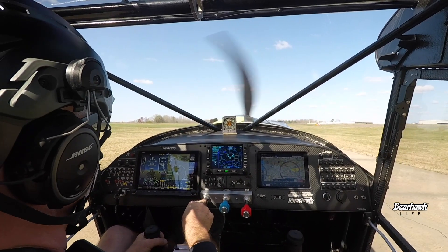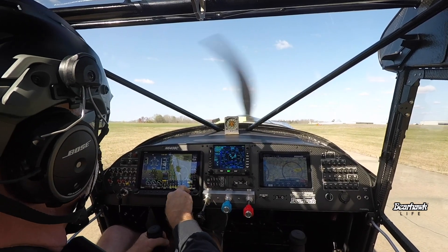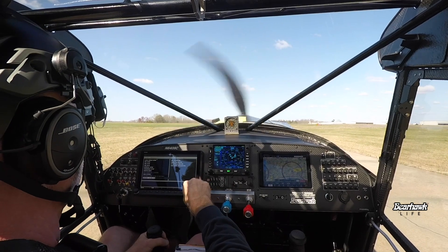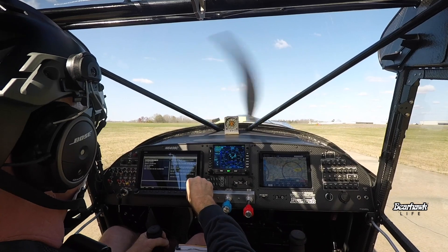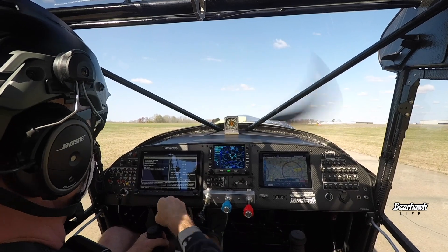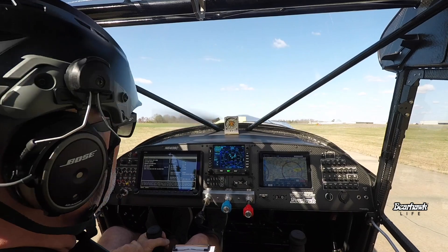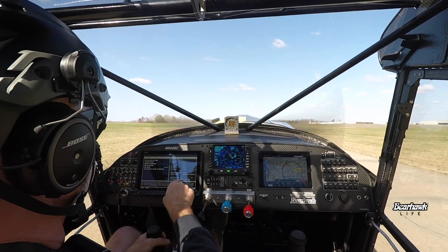Let me get this thing lined up on 360. Going into settings — hardware calibration, data, AHRS, compass. At 360 without calibration, hitting North. It's got its percent gauge, telling me it's calibrating itself. Once it hits 100, that light will turn green.